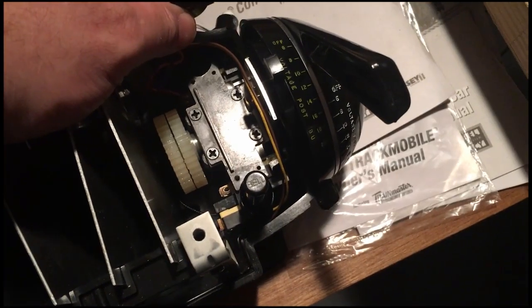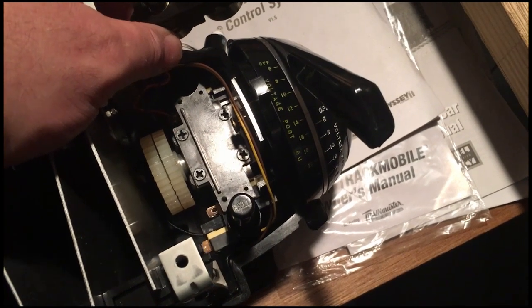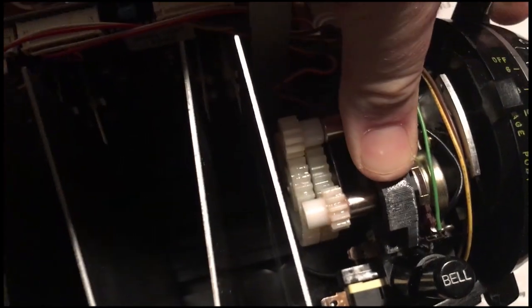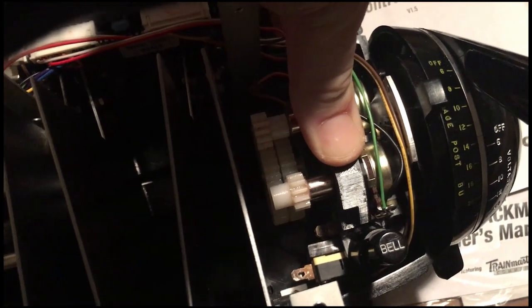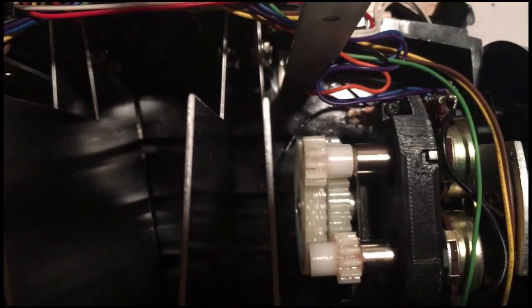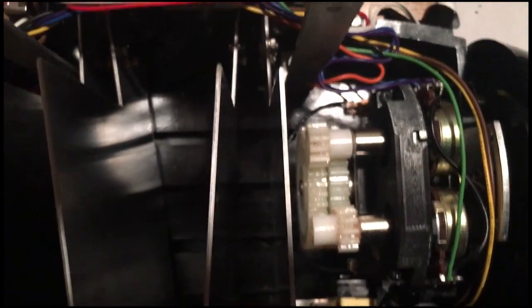Set your handles to the off position, both for the accessory terminal and for the throttle. I haven't tightened the screws yet, so holding your thumb down on here, adjust the throttle, and make sure everything works. That can go the whole distance. If you notice that it doesn't hit the hard stop, you probably don't have the potentiometers rotated counterclockwise all the way, or you don't have the handles at the 0 position. In the past, with the old bracket, that gear would move toward the back as I advanced the throttle. It no longer does that.